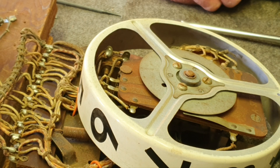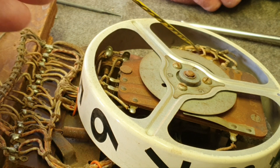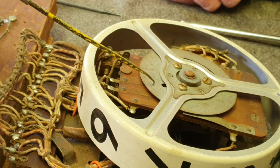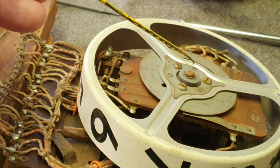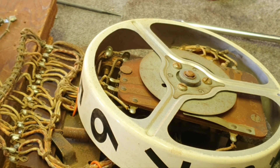Earlier versions had a form wire for an earth or common, which later ones no longer have. Now, before undoing the screws, take note: this plate is just a pressure plate to hold the score reel down, but this other plate is the grounding-type plate — it goes through these pins, two small and one large. When you put it back together, that's what you've got to remember.